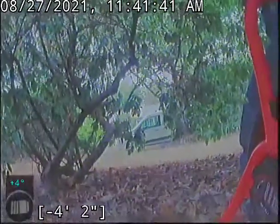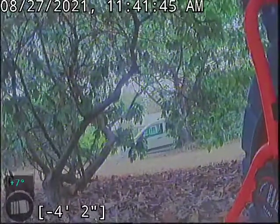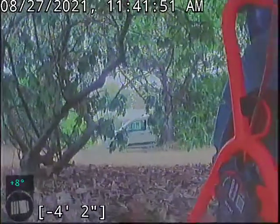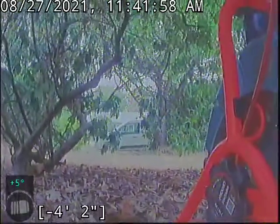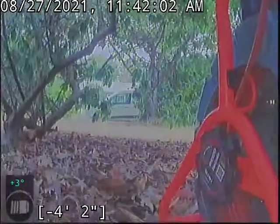This sewer line virtually runs straight out from this point. It does pitch slightly to the left of where we're looking right now over an extended period of time. And then it meets a dark center line out in the street, which is the city lateral coming right off the manhole. And that is precisely where it ties in. It's a very straightforward sewer. For the most part, everything's looking pretty dang good.